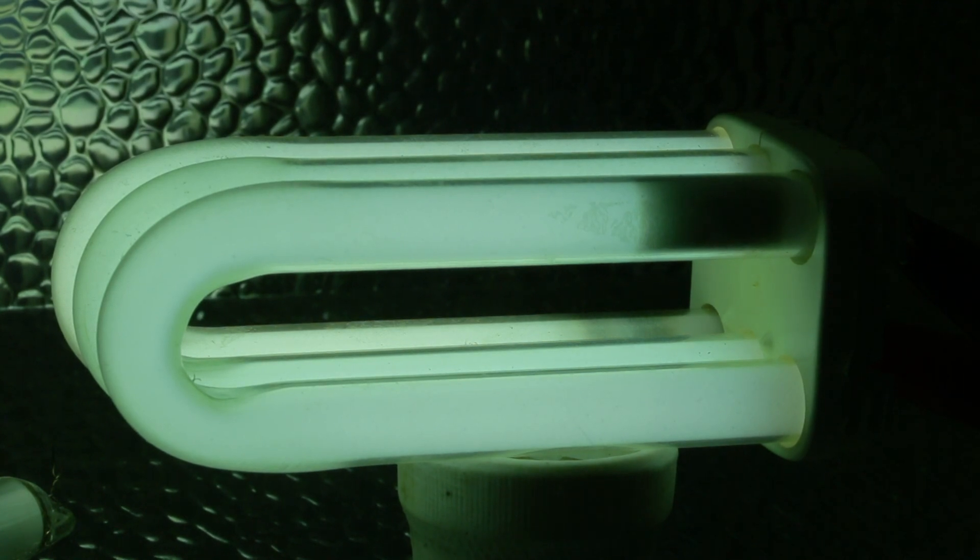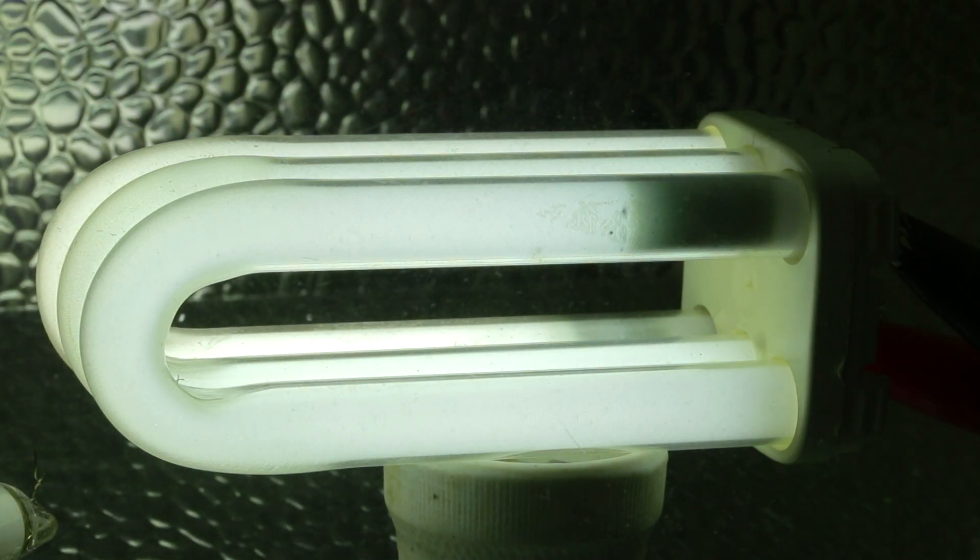I'm not having it. Where's my 400 watt gear? 10 more seconds, then I get the 400 watt gear out — I'm bored now. Alright, you've asked for it. Right, 400 watt gear — something smells. Phew, it stinks. Three, two, one. How is it taking 400 watt sodium gear? 4.6 amps — and it's a lamp designed for about 700 milliamps. I'm officially impressed though.